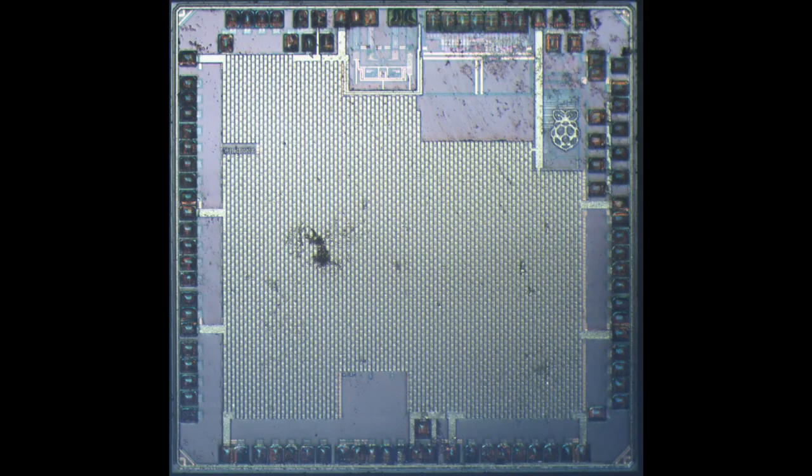Let's take a look at the next chip — this is the actual Pi Pico. It's very clear to see because here we see the Raspberry Pi Foundation's logo. If you zoom into the text in this corner, you would confirm this is the B-stepping of this die. Usually when you take parts out of the package they're not overly interesting, because most of the traces in the middle are basically power distribution. There's a bunch of logic sitting below, mostly low-speed digital logic and some analog. On the edges here we see the pads — most of these are I/O pads, about 28 I/Os in this assembly. There are also some higher-speed I/Os, including the USB interface. You can see there's no metal placed on top of the USB macro, because it was designed with great care and running metal on top would disturb its performance.